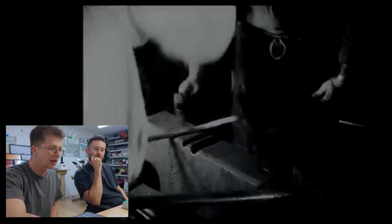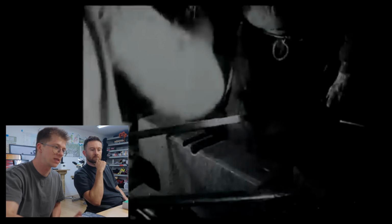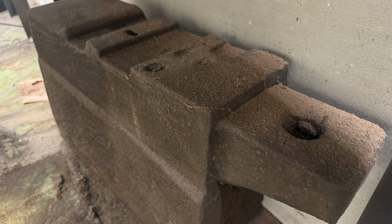And so what this looks like, this is a purpose-built anvil for barrel making, or purpose modified. But I'm honestly, I assume this is a barrel maker's anvil with swages in it for the common sizes. So it's nice and rigid, and you would just always have it there, ready and accessible. We could turn that knife maker's anvil into a file maker's anvil. Dude! Yes, we could. Or we could restore the knife maker's anvil and then make keyed in inserts of swages. That'd be super authentic as well. Shoot, how far do we want to go down this rabbit hole?